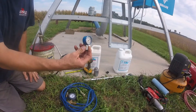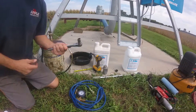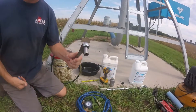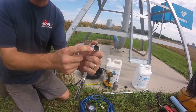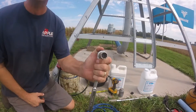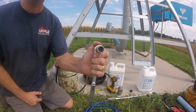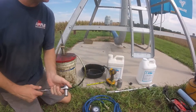Or you can just use a standard air gauge. You need an eight-point socket that is nine-sixteenths of an inch. An eight-point socket has grooves so it fits on the square plug — it's used for the plug on the center drive and the plug for the gearboxes.